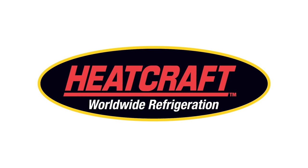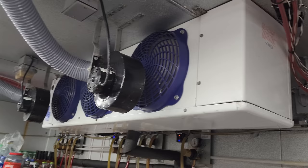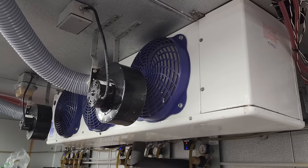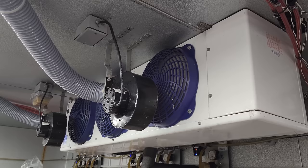Today we are doing a scheduled meetup with the electrician because we're getting ready to replace this evaporator coil — it has several refrigerant leaks and the customer has opted to replace it. This customer provides their own equipment and they've already shipped me the evaporator. The new evaporator is going to be an intelligent evaporator, and in order for an intelligent evaporator, especially one that has electric defrost like this one, it is originally controlled by the condensing unit on the roof, so the defrost clock and the communicating heater wires are run from there.